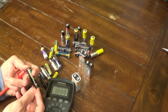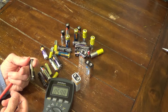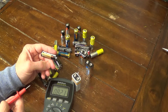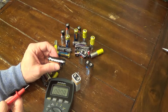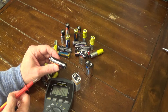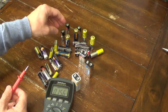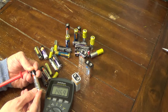These ones laying down I think are pretty dead, so we'll test this one — it's showing 0.998 volts. You might say that's pretty good, going from 1.5 down to 0.998, but really when batteries drop below about 1.2 volts they're considered dead for 1.5-volt batteries. Between 1.2 and 1.35 volts they're generally still usable depending on the device. Anything above 1.35 volts is still pretty good. This one at 0.9 volts is going to be discarded.